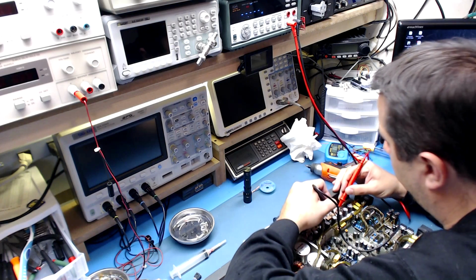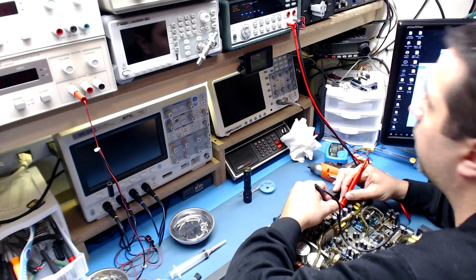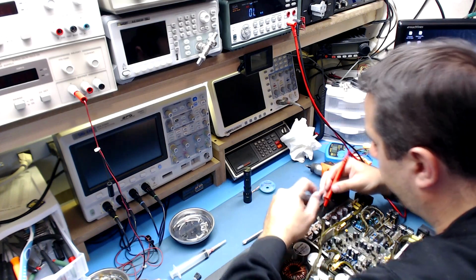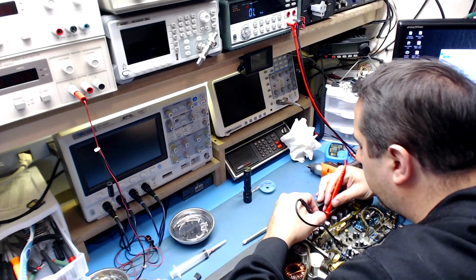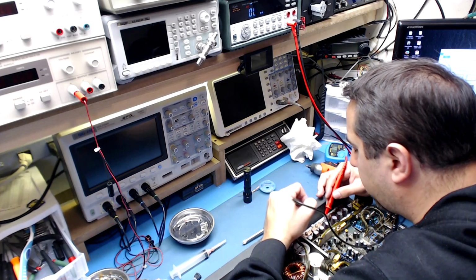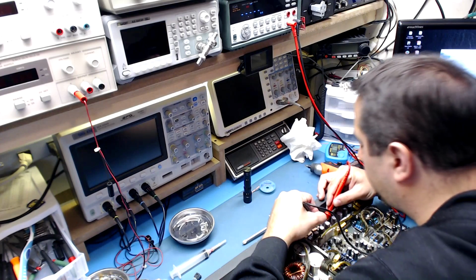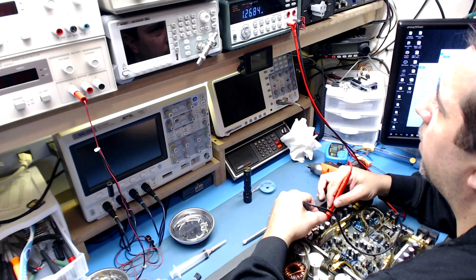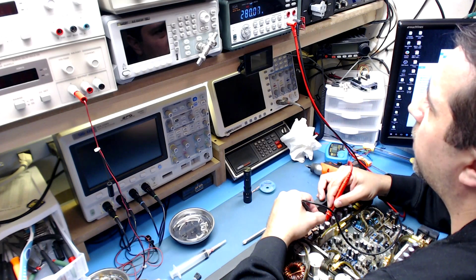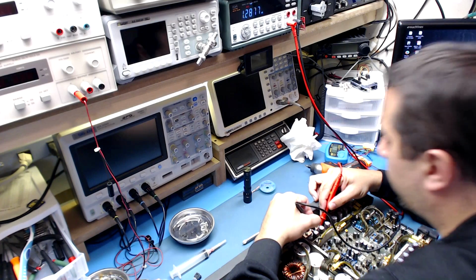I don't know about that 800 ohms there. That seems a little low. 800. This is on that side where those parts were removed. So I'm seeing a FET that was replaced in this channel in that quadrant that we had the parts missing. So yeah, there are issues in this side of the amp. 280 ohms. Yep. Okay. So we're definitely seeing some problems here.